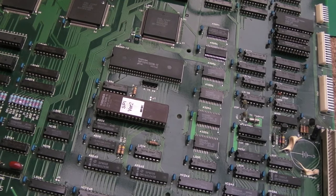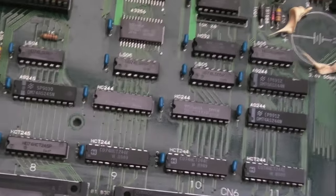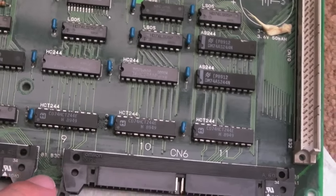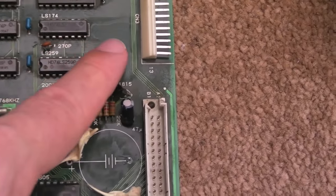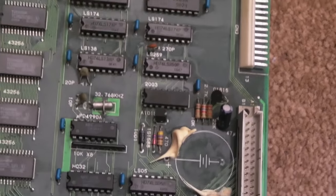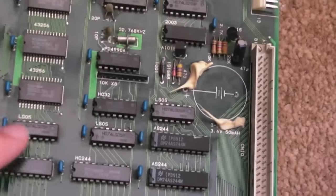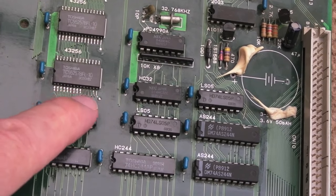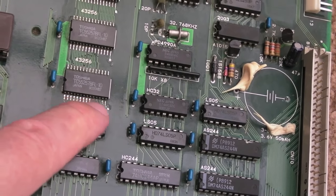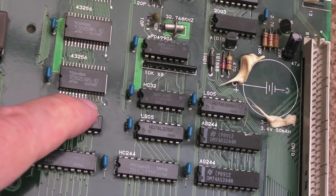So here's a quick update on how I'm getting on - it's looking a lot cleaner. There are still lots of dirty patches and areas that are very difficult to clean. But you might be wondering why - what are the benefits of doing this? Well, there are a few things. Can you see here we've got some dull pins there on those four or five pins on what I think is backup RAM? That needs reflowing. And then I did test briefly before to see if it gets sound, and there's no sound coming out of this at all.